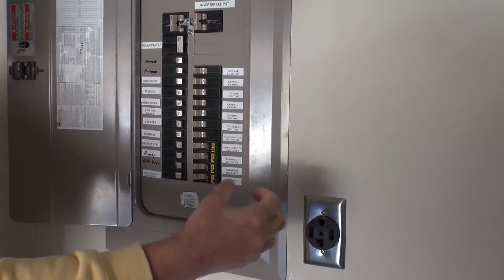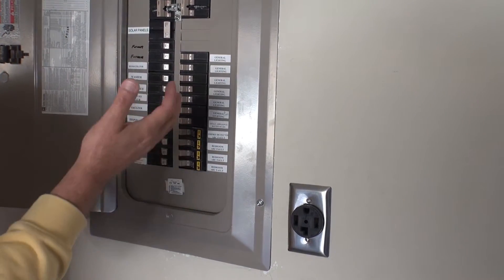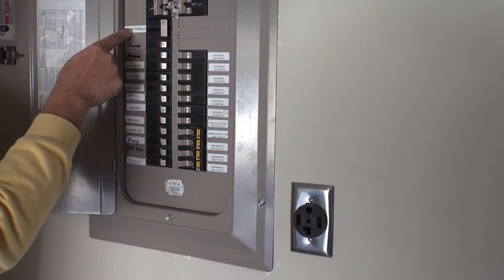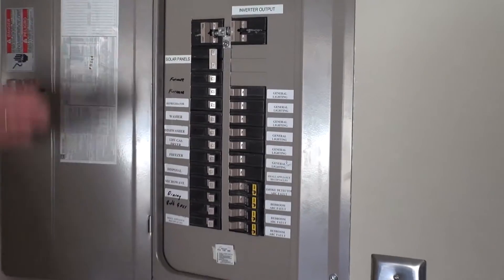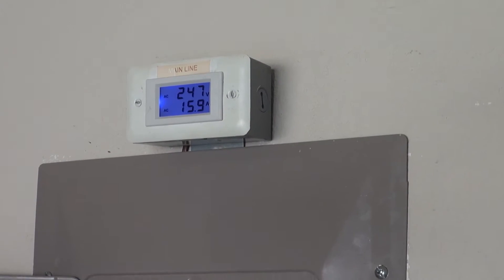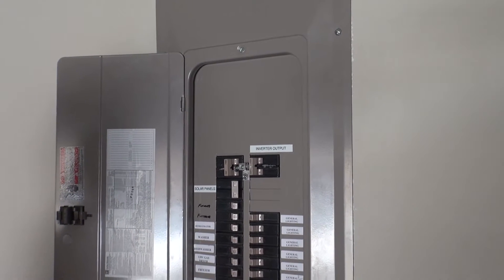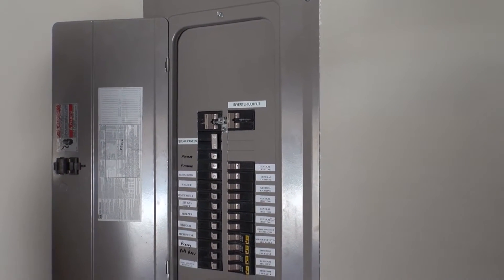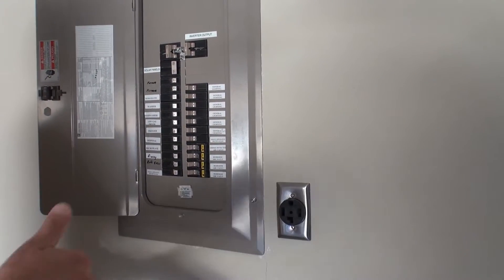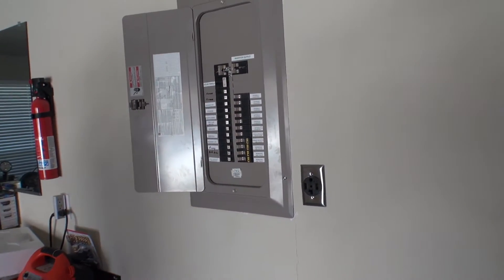From that moment, I can use my inverter and power up this subpanel. When the subpanel gets powered up, the solar panel right here is going to get powered up. After five minutes they come on and hopefully generate the same amount of power that I'm seeing right here. If I'm using them inside my house, great. If I don't use it, whatever I'm not going to use goes to the battery. When the battery starts overcharging, the dump load is going to kick in — more and more load is going to come in to eat up the extra power being generated by the solar panel.